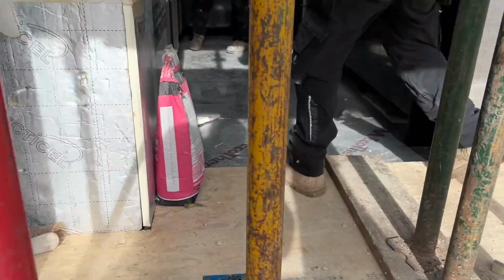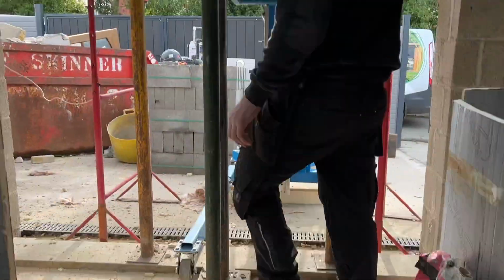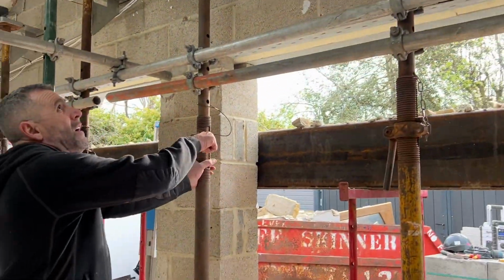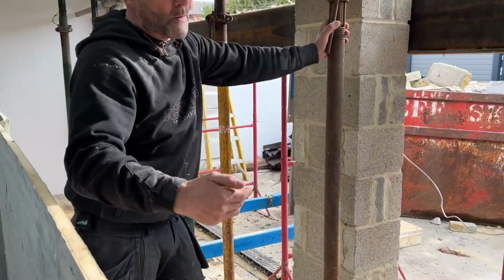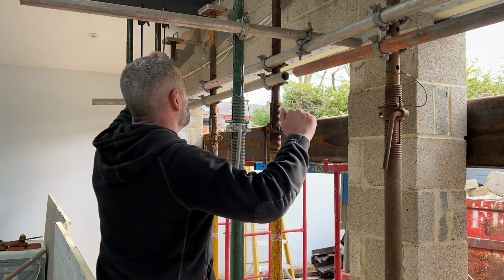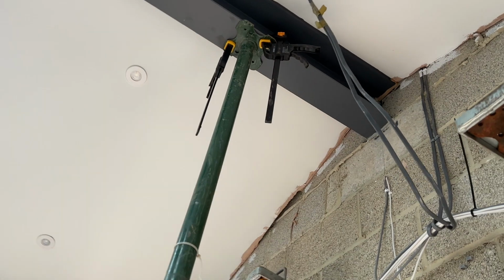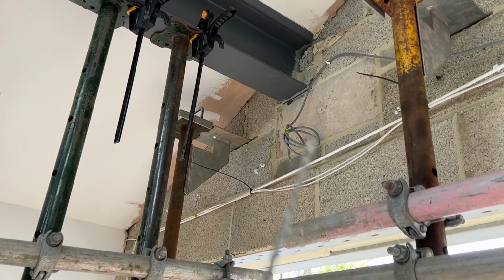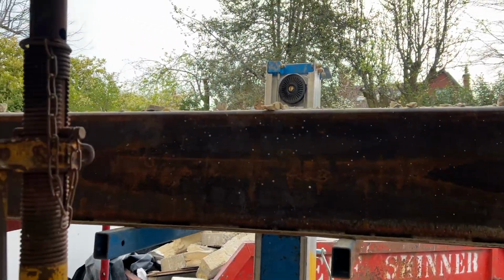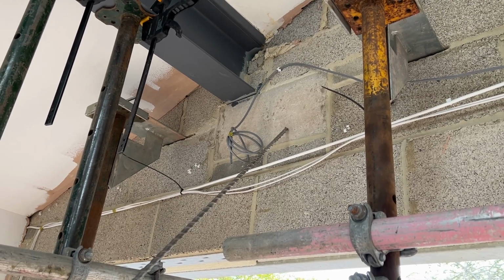We've opted for 100mm PIR floor on ceramic tiles. If you have a look there, David, look. I'm kind of hoping that doesn't compress. And what we've done, we've tightened these up, but not over tightened them, just give them a little bit of a nip. Otherwise, if they do compress, they compress more and then possibly damage tiles. And I've just tried to tie everything in. I'm only putting 1 prop on this one because we've got the pad up there and the wall is supported, whereas these pads here, I'll show you, my steel there is 300 beam and an 8mm plate, so I'm looking at finishing about there. So that pad will have to come out, and that one over there, and we'll cut them down and bed them back on.